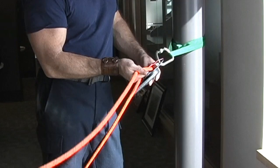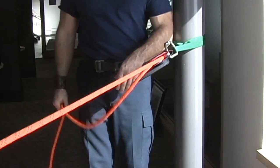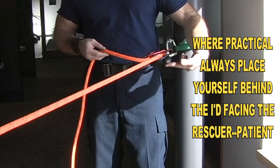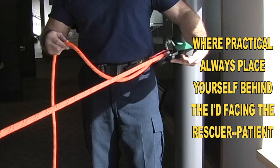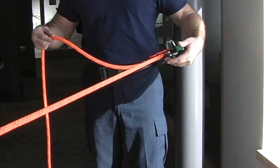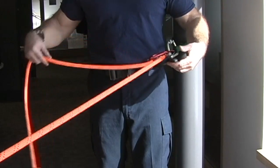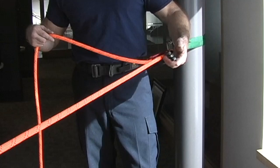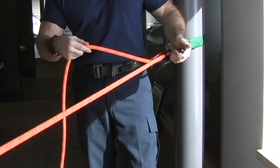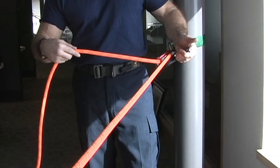Once it is under tension, the device becomes very easy to operate. It's problematic when it's not under tension — the sweet spot for the downside of the handle becomes very problematic. I'm going to take my standing end, or running end, and keep an eye on the working end. As we know, our lifelines all have tracers in them so I can see how many inches per second my lifeline is traveling. Ready on down — down slow. And we just feed around and down. Operating the ID for descent is as simple as that.